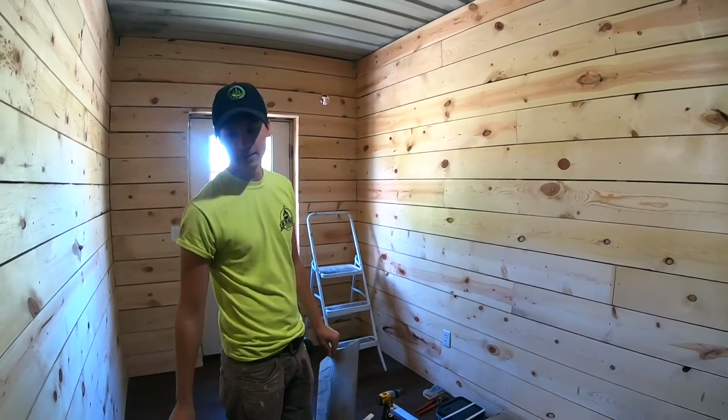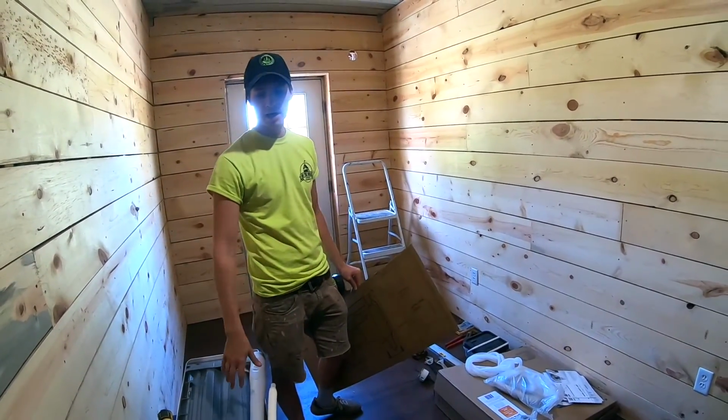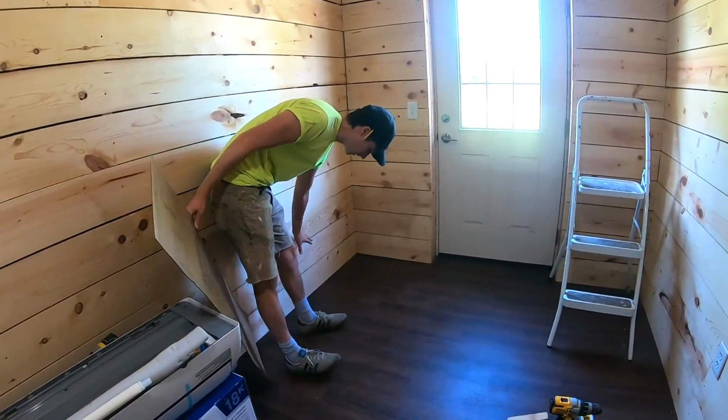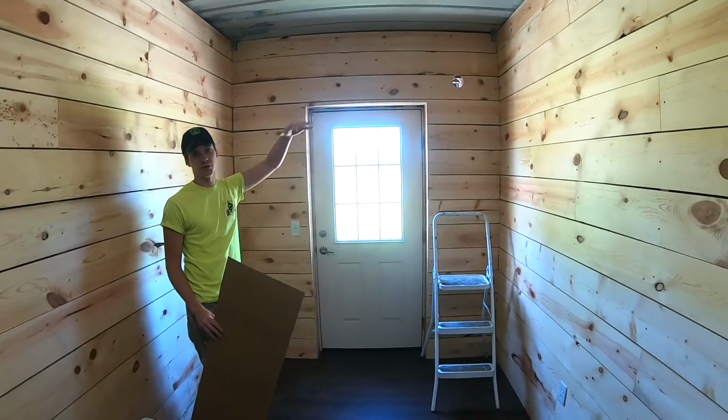Also, that could just damage your unit, and the way that the fans are on the unit, they open up at the bottom of it. So if you had a wall mounted unit right here, you'd be cooling your ankles, you know, if it was down here. But if it's up here, it's gonna be blowing the cold air down on you.